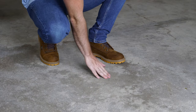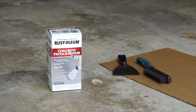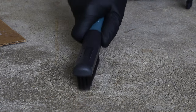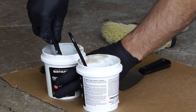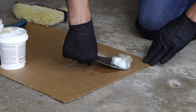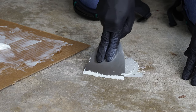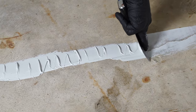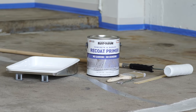You'll need to let the floor completely dry for 24 hours before continuing. You know it's dry when there are no dark spots and it feels dry to the touch. Now it's time to repair any cracks or holes in the concrete. Rust-Oleum Patch and Repair is a great solution for filling in any small cracks or divots — it's a two-part epoxy that creates a material stronger than concrete. Be sure to remove any remaining dirt and debris from the cracks. You'll need a clean piece of cardboard and a putty knife to mix the two parts together. Mix only what you'll use in 20 to 30 minutes because the epoxy will harden. Mix the two parts until it has a putty-like consistency, then use a putty knife to spread and level the epoxy evenly over all damaged areas. Allow the epoxy to dry according to the package directions.